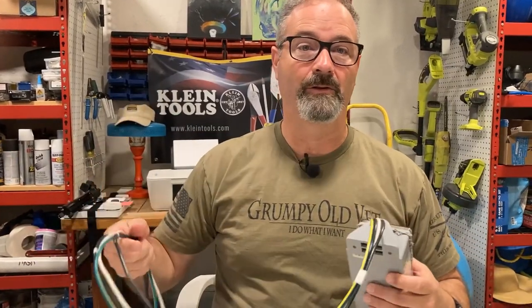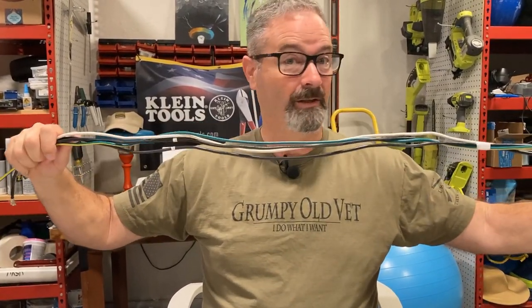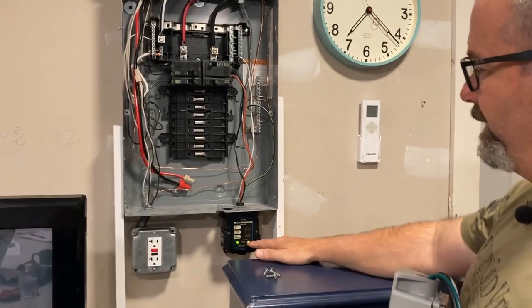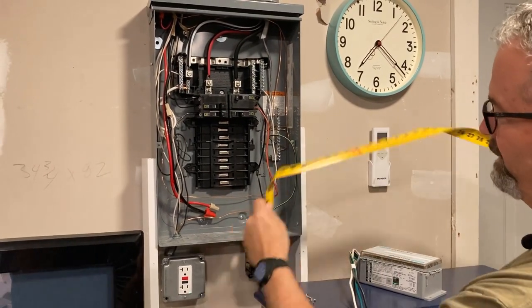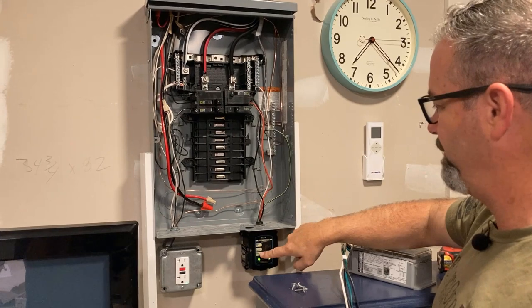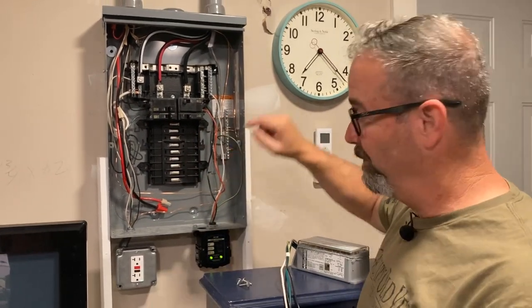We want the best VPR — we paid the money, got it installed, did all the research. But then because of framing, blocking, or whatever, we end up with much longer leads. The upshot practically is: if you're not keeping those leads short, you're not installing what you bought — you're getting something with a much lower standard. Let's go to the panel. We've already got an Eaton Ultra installed here. If I move this breaker down, I'm pretty close to that magic six inches.